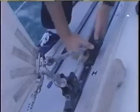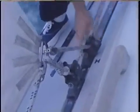As the helmsman slowly luffs up, all the windward telltales should lift at the same time. If we see them break first near the head, while the lower ones are still streaming, we know that the head is not trimmed hard enough, and the lead should be moved forward. Now all the telltales lift together.